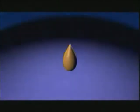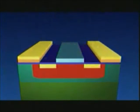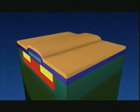Another series of treatments involving lacquering, exposure, bombardment with atoms which penetrate the silicon, new oxide layers, etc. is performed until the whole pattern is complete in all its layers. Some 300 to 400 process steps are required, along with 15 to 20 different masks with microscopically small patterns.